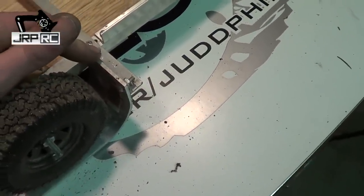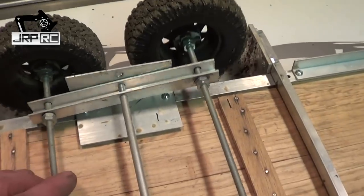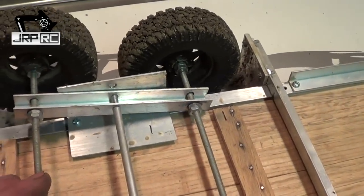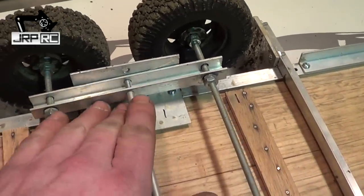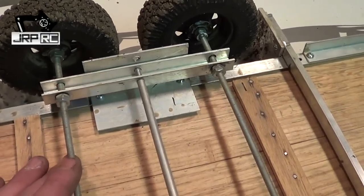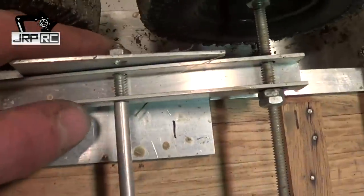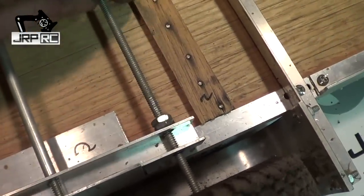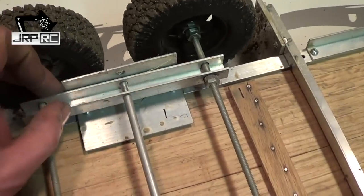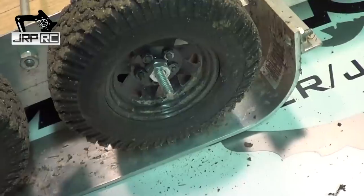Here are those half-inch angles for mounting the wheel wells. The wheel wells are made out of two-inch by eighth-inch flat bar. The axles and suspension are on a pivot — not really sure what style of suspension you'd call it — but there's a main pivot, and it's all made out of number-ten all-thread. There's a piece with double nuts on both ends so they won't come loose while getting worked back and forth. The axles are just number-ten all-thread run through two pieces of half-inch channel for the suspension, with nuts holding on the back and front outside.